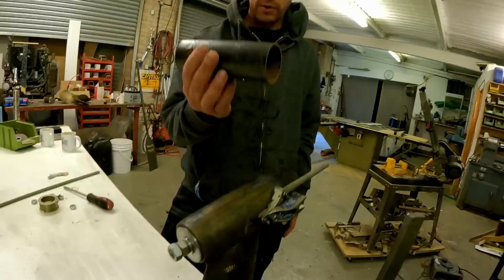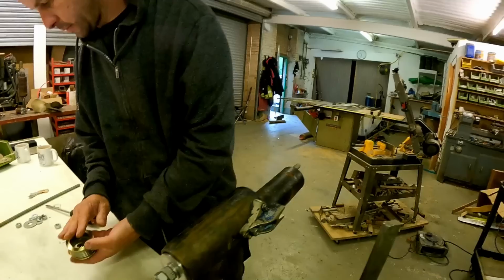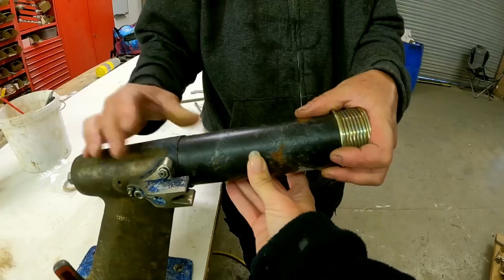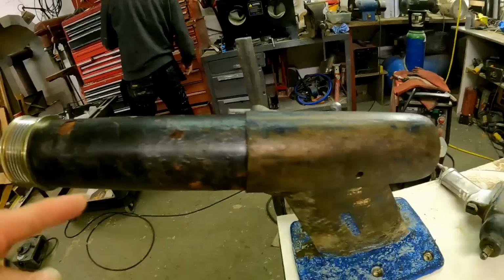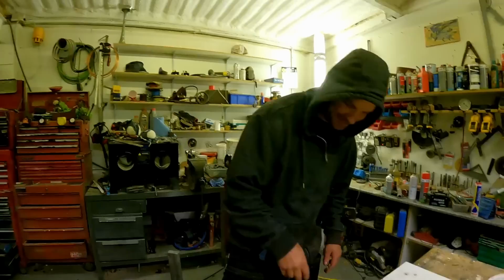The only thing I could find was a piece of jaunty old tube, so I'm going to put that on there for now. Hopefully this tube doesn't collapse. And then a big set of washers. So our plan is tighten this. That'll pull that washer through and hopefully... Definitely, it's dead easy. Move the cutlass bearing. Right, what could possibly go wrong?